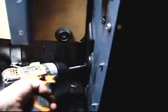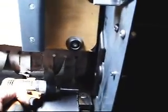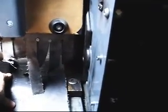Alright, as I was saying, on this side by the ball door, you got a lot more plastic sticking out here, molding, and you're not going to get your drill close enough. I wouldn't recommend using a drill. If you put it in the hole sideways and you end up chewing or wallowing out the hole, you're going to create a bigger problem for yourself. So I'd suggest go ahead and get you a ratchet at this point. Extract all these with a ratchet.